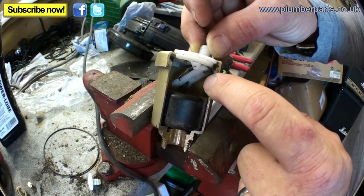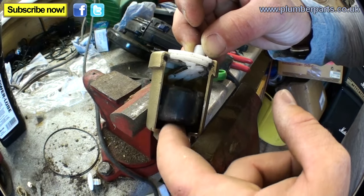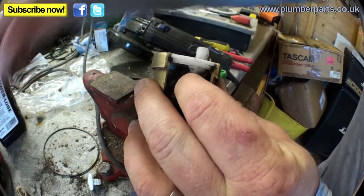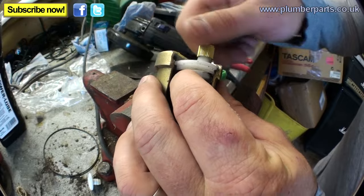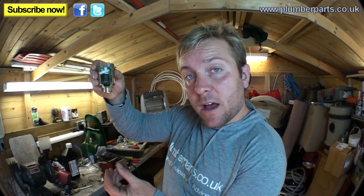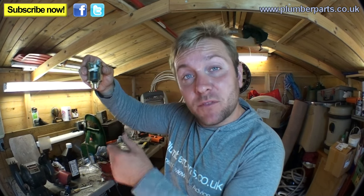You can sometimes have problems with these — they'll get stuck in the open position. Just grab a hammer and tap them, which sometimes helps. They can also allow water to still pass by when stuck, but you've got the backup of the small nipple on top that you can do up to seal it off. These are often used on horizontal runs of pipes, especially in bungalows with long horizontal runs where there's a slight lift in the middle. If you've got an automatic air vent like this, try to get it about a foot above the pipe you're trying to vent. Also put a small isolation valve in there so if you have any problems, you can turn the isolation valve off, remove the air vent, and service it.